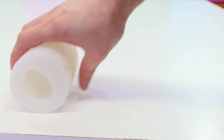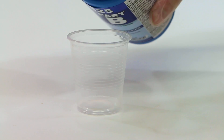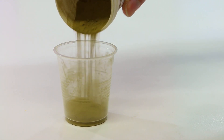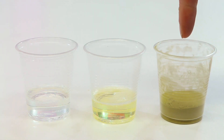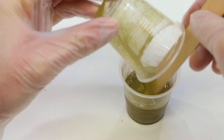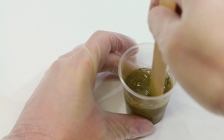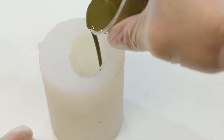Okay, the mold is done, now for the metal part. This is what I used to make that happen — some brass powder that'll be mixed into some clear resin. So I poured out equal amounts of both parts of resin, and then poured out an equal amount of the metal powder. Mixing the powder into one of the halves first before mixing the two parts together will make it way easier to get everything thoroughly mixed before the resin starts setting. So I mixed the brass powder into part B of the resin first, then mixed in part A and poured it into the mold.